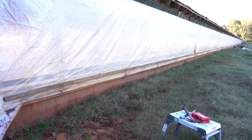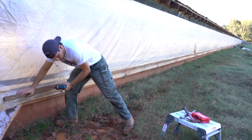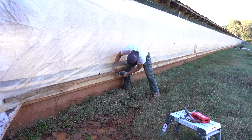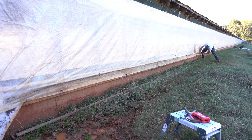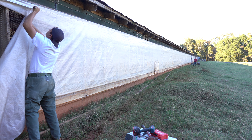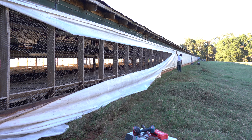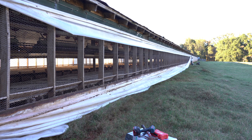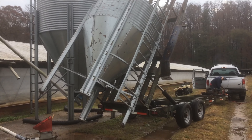Another part we repaired is the front right curtain. Curtains in chicken houses are safety mechanisms designed to prevent chickens from overheating during summer should any other equipment fail. When it gets too hot, the curtains drop down and allow outside air to come in. We were replacing the front right curtain because it had too many holes in it — when a curtain has too many holes, too much outside air comes in while the AC system is trying to keep the chickens cool. I have a video going over the chicken house AC system if you'd like to learn more.